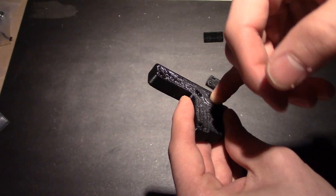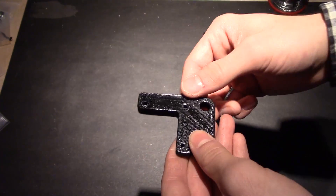Actually, it's like my first 3D print — this little calibration box I printed. The first layer was crappy but I saw that if it kept going in the same motion it could eventually correct itself, and it did. Same thing for this piece — it kind of just kept going, it corrected itself. The holes that are 3D printed seem pretty good and pretty intact. I'm hoping that when I drill them out and tap them it doesn't ruin them and they fall out. That problem I mentioned with the Z motor mount where the holes were loose — this falling-out idea is the same thing: the circles printed inside the 3D model just fall out because they're not properly attached to the rest.